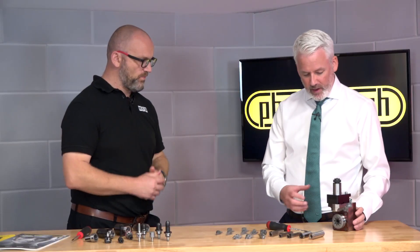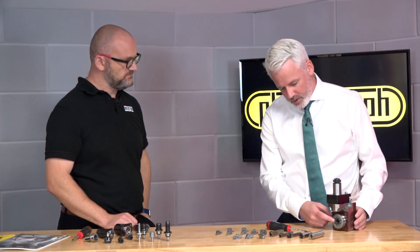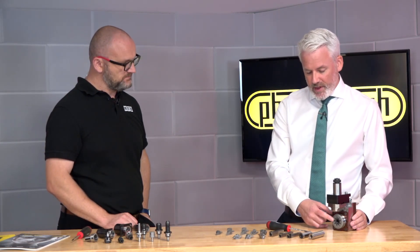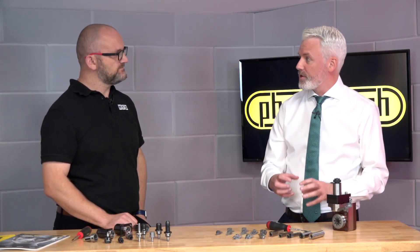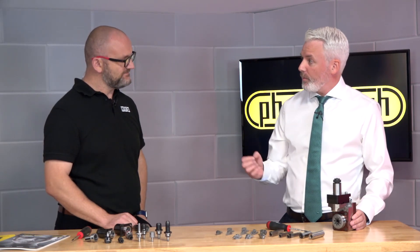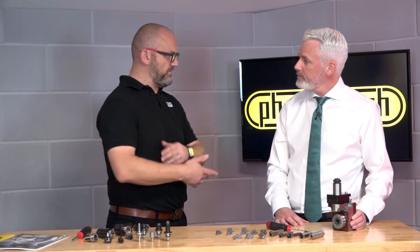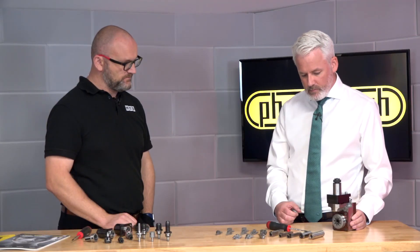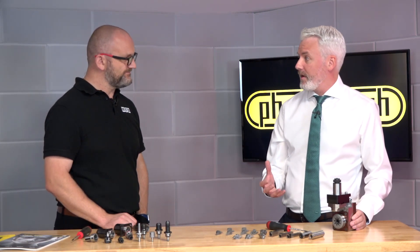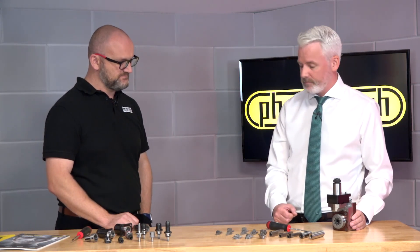Turbo whirling is a concept Horn brought out a few years ago. On this tool you can see there are nine inserts - six of those have the finished profile of the thread on them and three have a simple square profile and they're set back a little bit from the finish profile. The three roughing inserts peel the bar down to the outside diameter of the thread, leaving just a finishing operation for the six remaining inserts - so roughing and finishing in one operation. This has clear benefits for producing long screws on a sliding head machine, and most examples of this would be applied in the medical industry for bone screws.